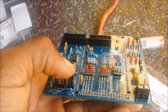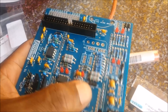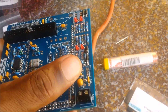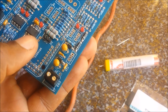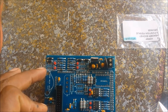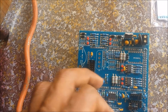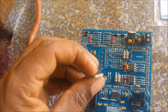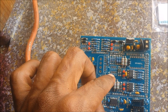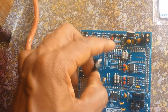The coil drivers are in, IC4 as well. The female header for the VR conditioner comes in two pieces and is in place. You would also put in the header for the stepper motor — I'm not going to be using that so I won't bother. Next step we're going to put in the MOSFETs — there are eight of them, Q1 through Q8, plus the power regulator. Looking at Q8 for example, you see three holes and three smaller rectangles — the smaller rectangles align with the tab on the MOSFET, so the tab faces that direction.